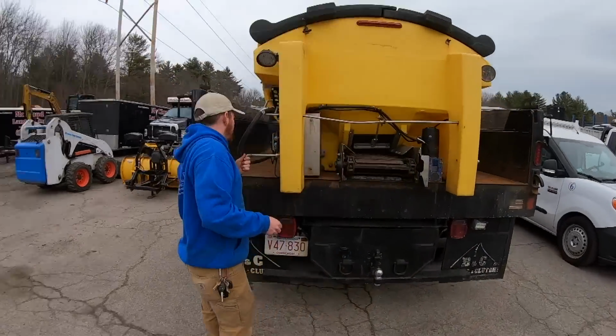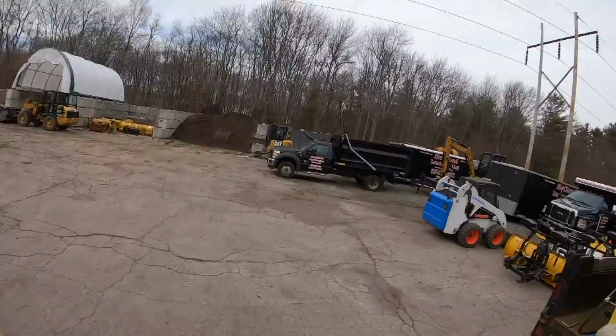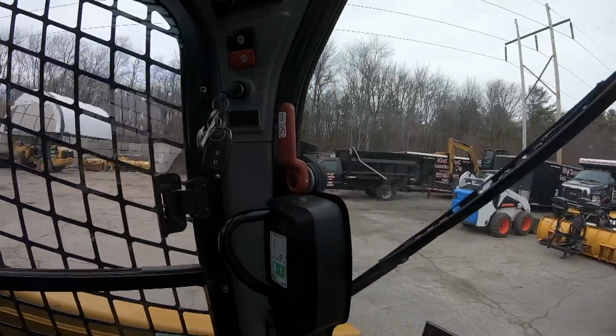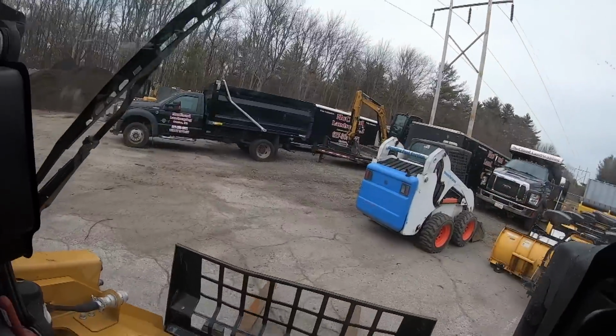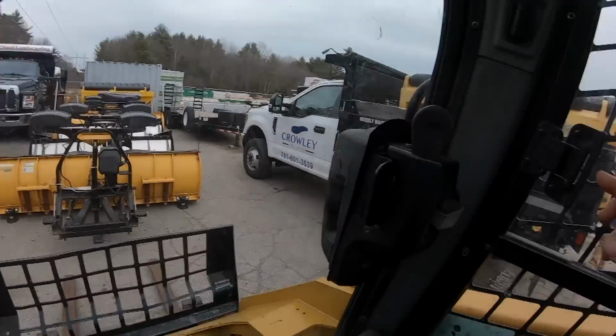Straighten it out real quick and put the straps on and plug it in. It took literally 3 minutes. So if you're trying to do this by yourself, you probably can. You're just gonna be able to get the spreader off the pallet. But before, we would use straps or lift it with chains. This is definitely the easiest way we found. Put it on the pallet, lift it up, drop it, lift the spreader, pull the pallet. So as you saw, how easy that was. Now we just gotta strap it down and plug it in, put the spinner on, make sure everything works, and then we're done.